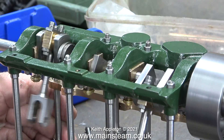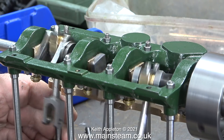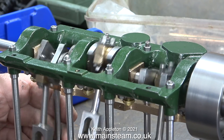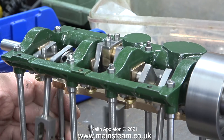I'm very slowly turning the crankshaft using my electric drill. The crankshaft is technically very good indeed and the fit of the split bearings to the crankshaft is very near perfection. The tapping you can hear is the ends of the connecting rods hitting the crosshead support bar.